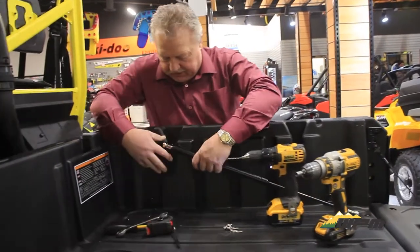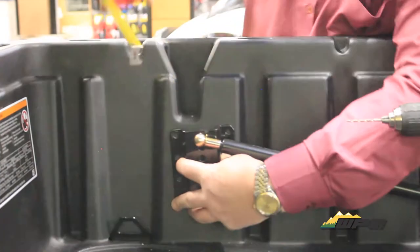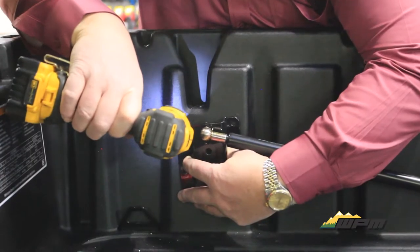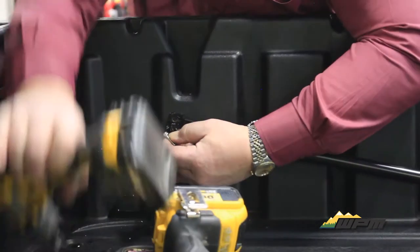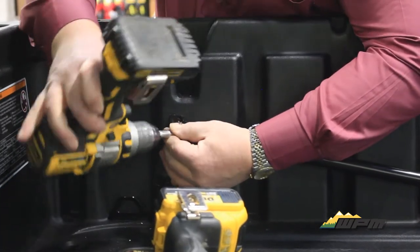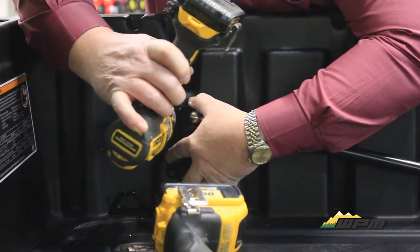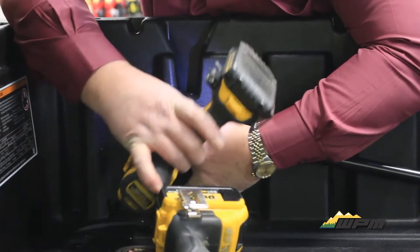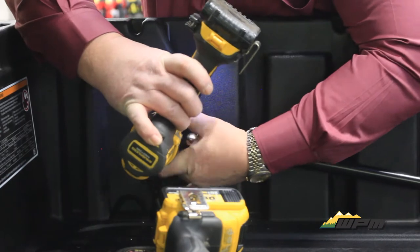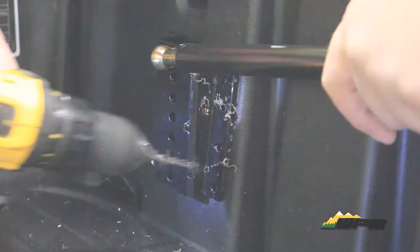To put this on, we'll take a measurement — it'll be three inches to the top. We'll take a nut driver and put a screw there just to help hold it. You've got to be careful when you do that; you don't over-tighten the screw. I'm just drilling through just to get my pilot hole started.